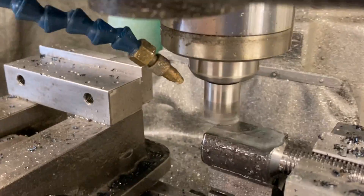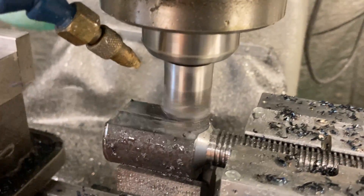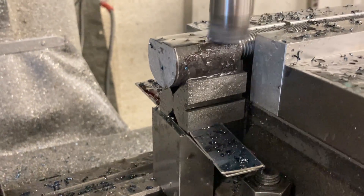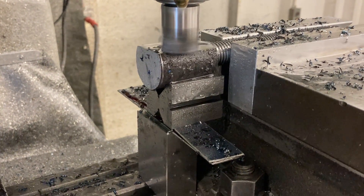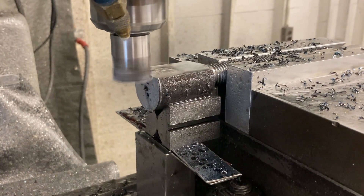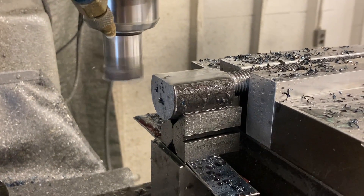I don't want to stand in the zone of the chips — things are hot! Even with the vibration of that cutter, that block moves around a little bit — it's not in the same spot it was when I started. The harmonic vibration causes that stack-up of blocks to dance around a little bit. I've got to keep an eye on them, make sure they don't slide out. I walked away from it and I heard the shims fall out — and you can definitely hear the difference in the cutter when it's supported versus unsupported in the V.